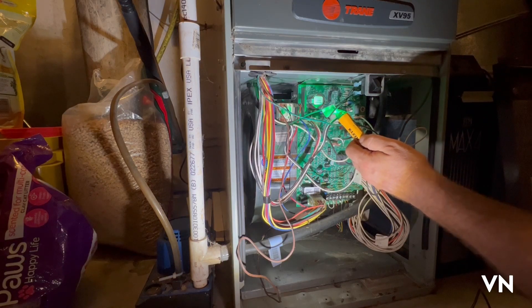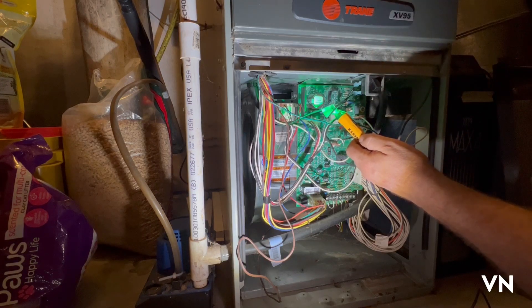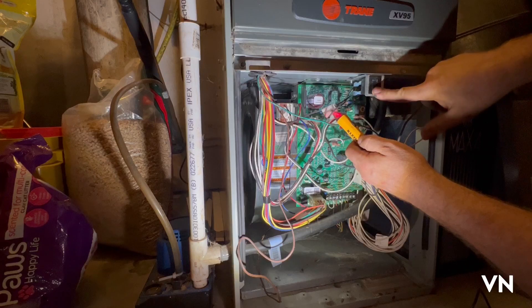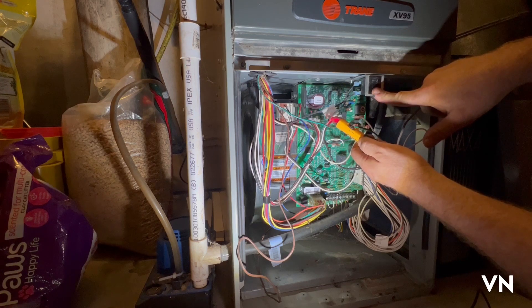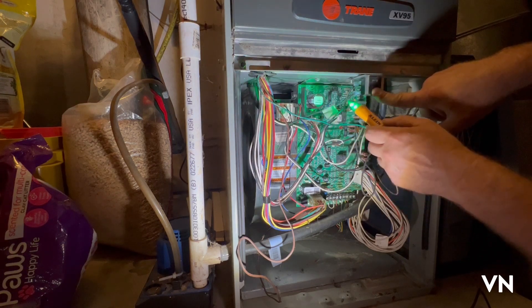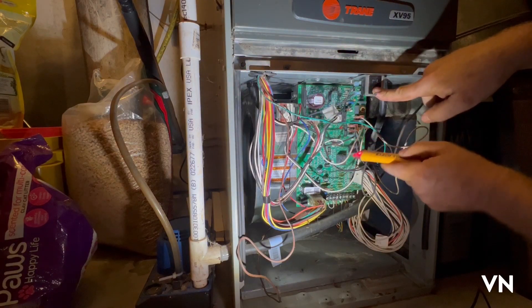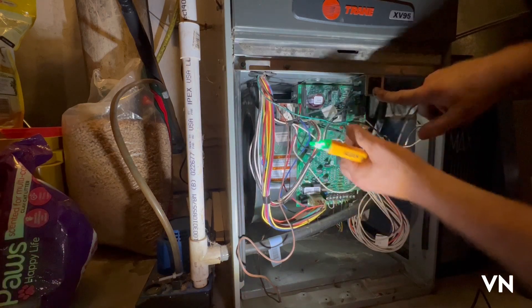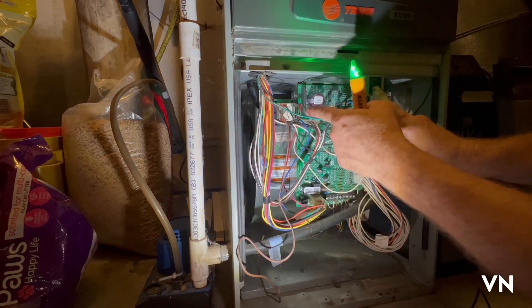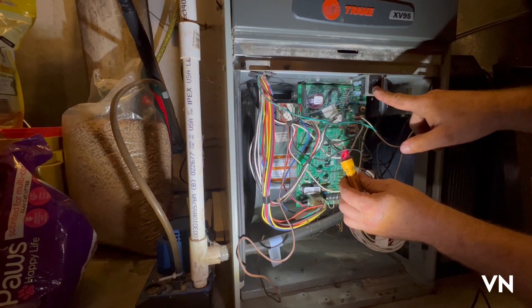If I hit my maintenance switch in the off position, no matter what I do, it kills the power in this box. So I'm going to turn the power back on. I have power simulating the door closed — I have 110 to 118 volts coming through here — and then it is going to come out of here, go into the circuit board, come out of the circuit board, and go over to this black wire here, which feeds the transformer up in that left-hand corner. I got power going in, so that's wall power to power the system.